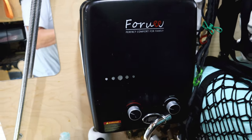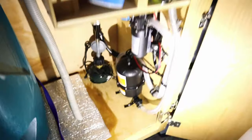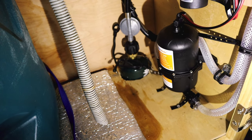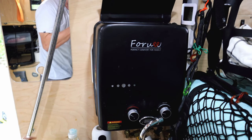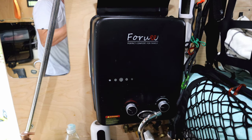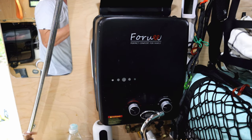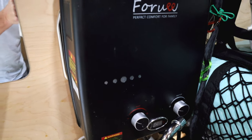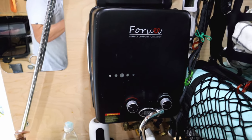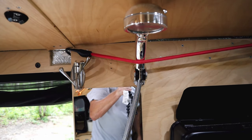Out of the accumulator output side, we run up to our various tees and then to our instant hot water heater here — propane-enabled. You can see my propane tank down below with a propane line run up. The way these instant hot water heaters work: if the propane is off, you get whatever temperature water is in the tank. If it's on, it'll ignite and start warming the water. So we can get cold water without the propane, and with the propane we can get hot water out of both our faucet and our shower head mounted up there.